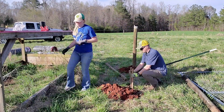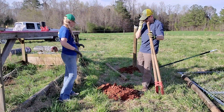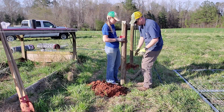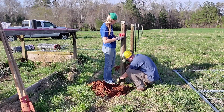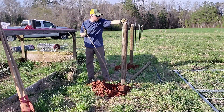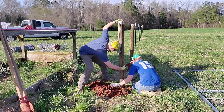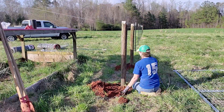We say we need buddies in order to get projects done, so we are each other's buddy. We're digging the holes for these posts — they need to be 42 inches deep so that your post is stable. Once you start packing in the dirt, you could do concrete. Usually we do concrete on gate posts, but we didn't have any, so we're hoping the dirt will hold it. This is only about a 10-foot gate. On our previous property we had a 16-foot gate and we did put concrete in those posts, and we've had no problems.